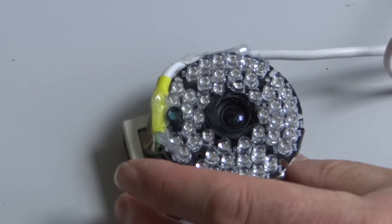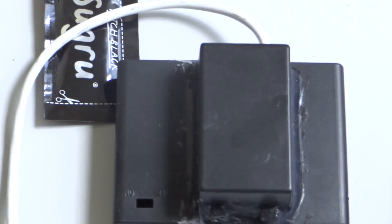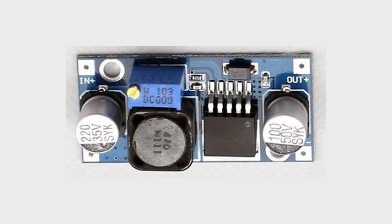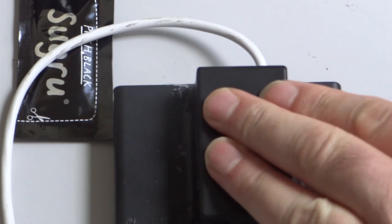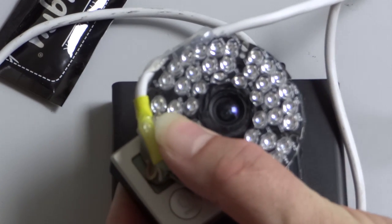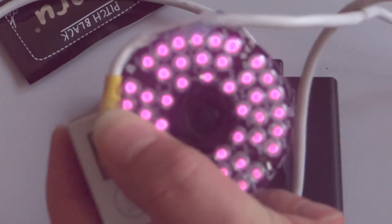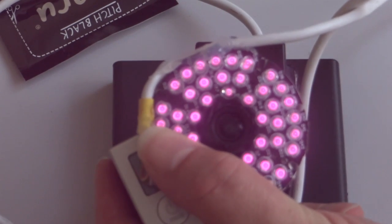And what happens is there's a little circuit which I've got in this box here, and there's 6 AA batteries in the base, and in this unit there's a converter to convert from the 9 volts of the 6 1.5 volt batteries up to 12 volts. All this information I'll give you in the description of the video. So basically what happens is it gets nice and dark, and these illuminate in infrared. And I don't know if you can just see that, they've actually come on there showing you the infrared illumination. What I'll do now is show you a clip of this in action.